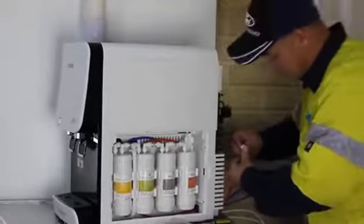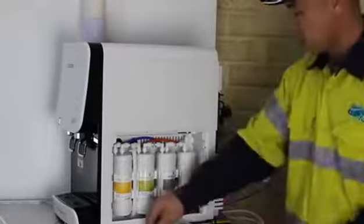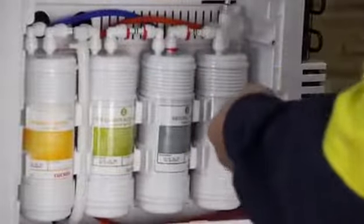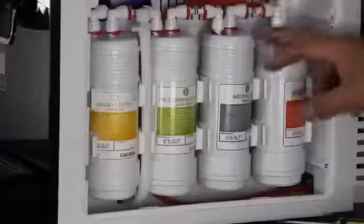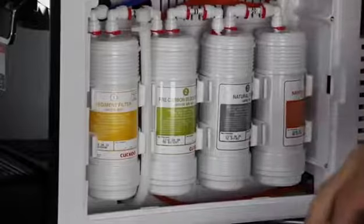Now, when you turn on the valve, the water will go straight to the water tank. It will take 3 minutes to fill up the tank. In the meanwhile, you can use a pair of long nose pliers to insert the red clip in between the collet ring and the quick connector. The red clip is used to lock the connection and prevent leaking. Try to put the red clips for all connections. When finished, if no leak occurs, replace the compartment cover.